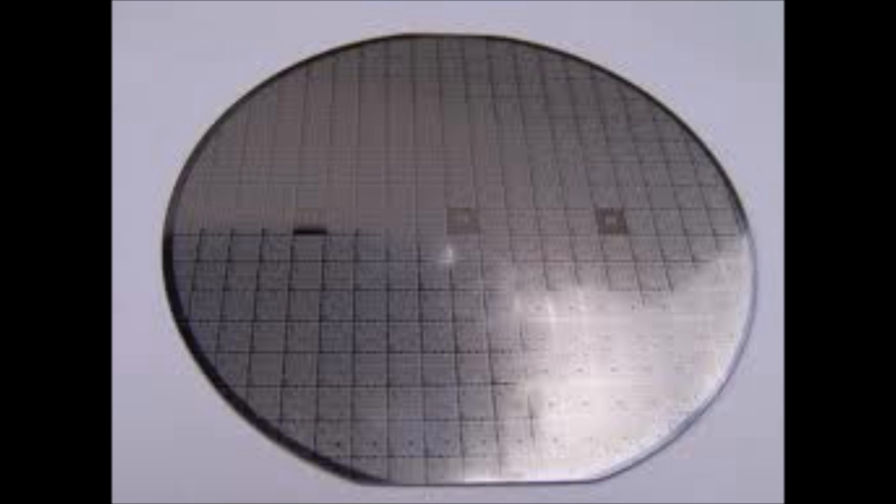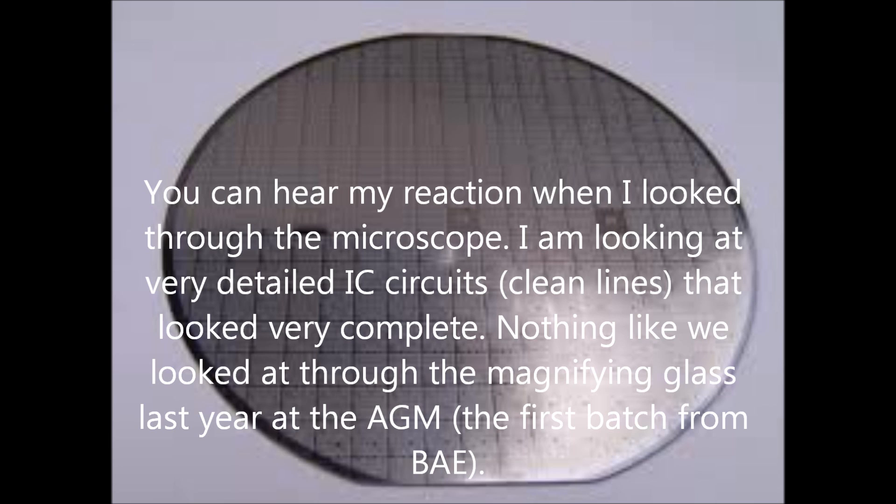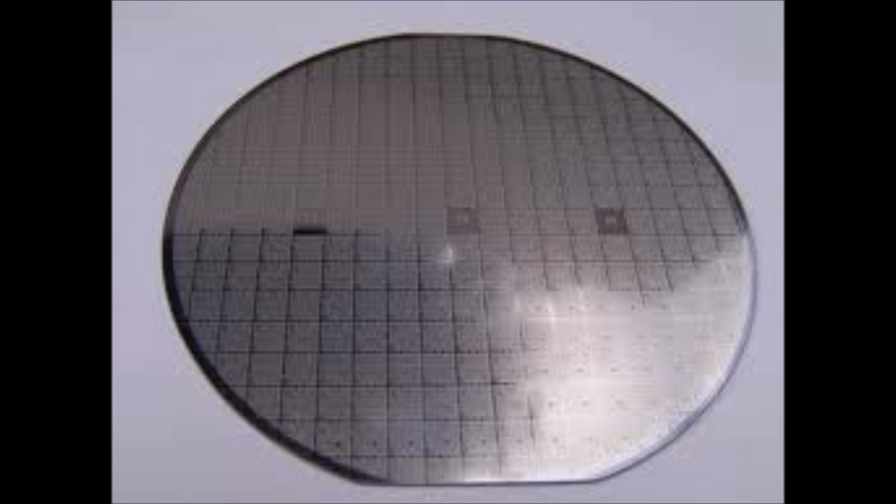There are connections to read the signal when they sense the intensity at a certain wavelength. This is infrared — like two microns, three microns, four microns. That's not visible to human eyes. Usually visible light is around 0.4 microns, not four microns. Each one can sense the same frequency — each single device you see is a pixel.